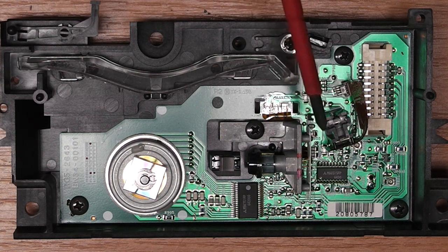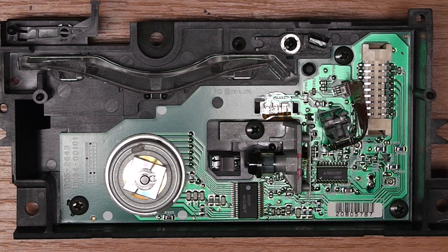Here is the laser diode. A word of caution before I say anything else. This laser diode is probably quite dangerous because it will in all likelihood not emit visible light. So if you try to play with that and you think it's not working but it's emitting a beam, you'll probably notice when it's too late, and that is when you're blind in one eye at least. So please be very careful with operating these. I don't actually operate those myself because it's just not worth the risk.